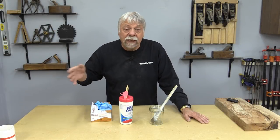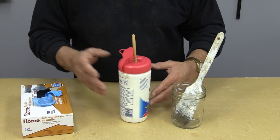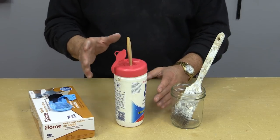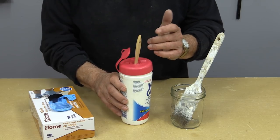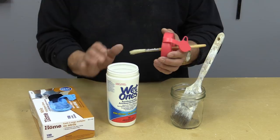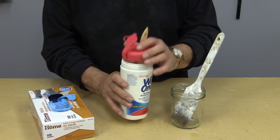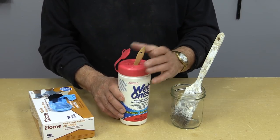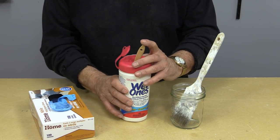While we're still on the topic of painting, let's have a look at brushes for a second. Sometimes you have a job that might last a couple of days, or maybe you haven't gotten around to cleaning — you've got something else you need to do — but you want to store your brush so that it doesn't get ruined. These are just disposable wipes with a dispenser top, so you can put the handle of the brush through there, put your fluid in — your turpentine or your cleaner — and just let that sit and soak for a while, especially if a brush has gotten hard.